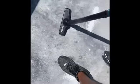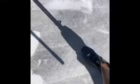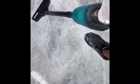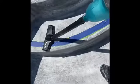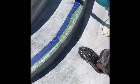In addition to cleaning the surface of the pool prior to adding the epoxy primer, you may want to keep a small vacuum handy so that you can remove any falling tree leaves or any falling debris that happens to blow in with the wind. I always like to keep a vacuum in hand to remove any of that prior to applying the epoxy. Remember that this project is based off of preparation, so the best preparation you can provide, a clean surface on your pool, will give you the best results at the end.